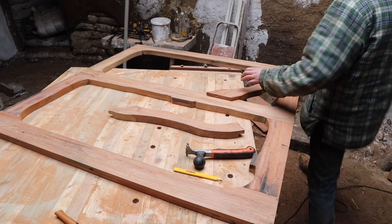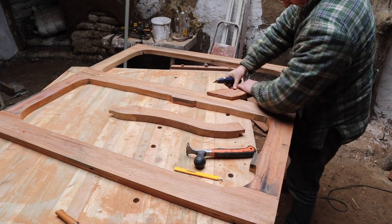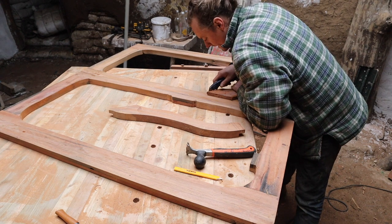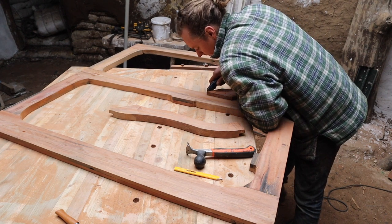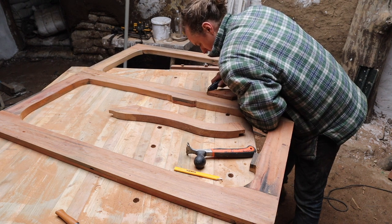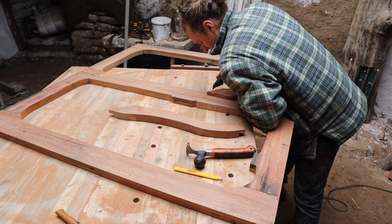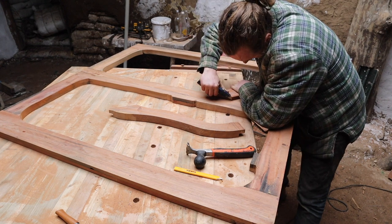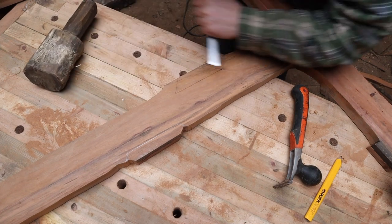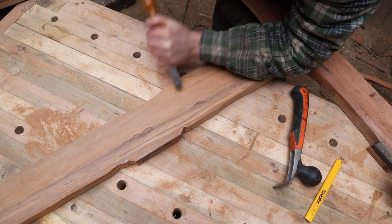Right, so with a nice sharp knife, I'm going to butt these up tight to where I want them, pull, and hopefully mark nice, crisp, perfectly sized lines. So yeah, now we've got these lines, first thing we'll do, we'll come along and chip out into them.